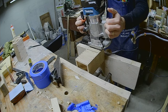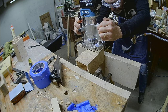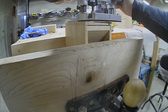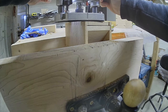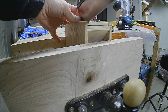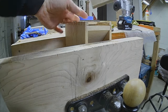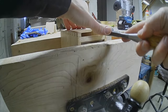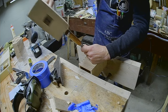Finally time to remove the box joint tower's lower front panel. I started with a router and a narrow bit. When the panel started to vibrate as it became less attached, I pulled out a fine dovetail saw to finish the cut. I used a chisel to flush up the remaining panel material to the tower wall.